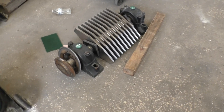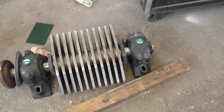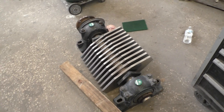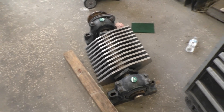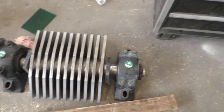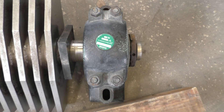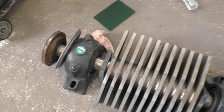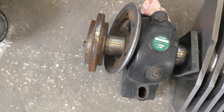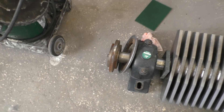This gives you an idea of the construction of the rotor. This is an 18-inch machine — we tore it down today — but you can see what that looks like. It has an expansion bearing at this end, so the shaft can move if it overheats, and a non-expansion bearing here, because this is where our Dodge coupling connects into the electric motor of the machine.